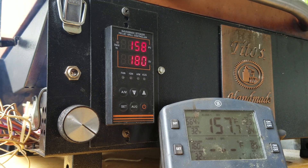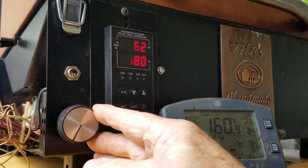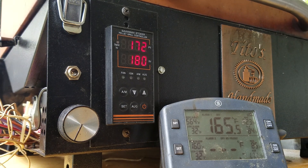We'll just let it sit there. Now I'm going to turn the rheostat down because I got a good start — I'll turn it down to about here and see what stability we end up with. You can see how gradual the startup is using the fan rheostat to reduce CFM and also using a manually tuned PID system. It's just creeping up gradually.